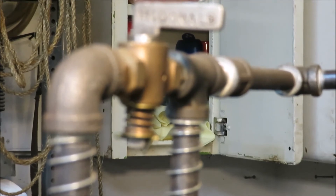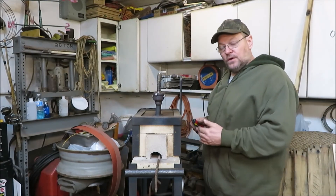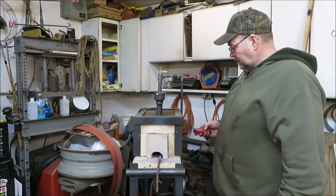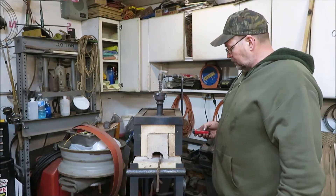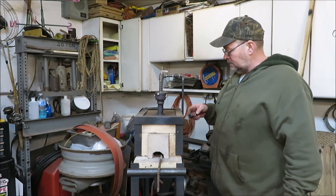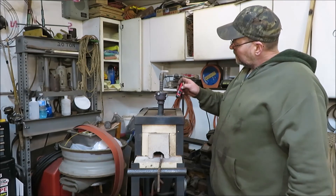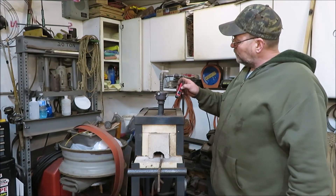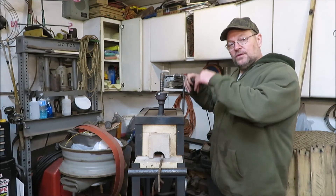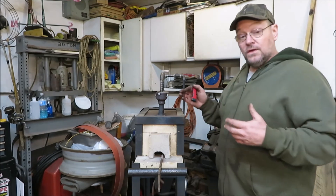So let's go over the forge a little bit. Now for the outside of the forge — I know a lot of people ask how hot the outside of it got. Running this on it, it's about 227, 231, 232 degrees. 232 is the highest I got on there, and that's directly on the side. Now going down on the top — surprisingly it's cooler: 224, 222, 225 on the top. That's probably because we're forcing all the air and heat down on this thing. I'm sure as it shuts off it's going to heat up hotter on the outside.